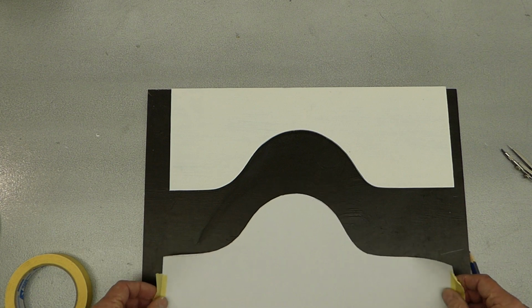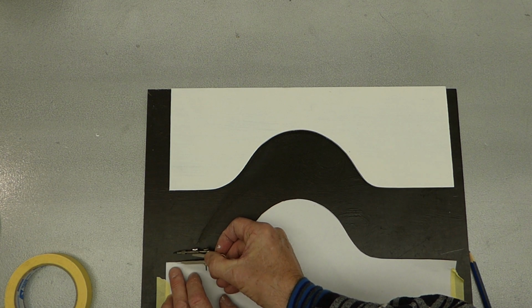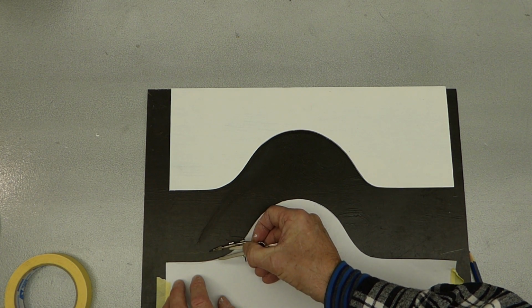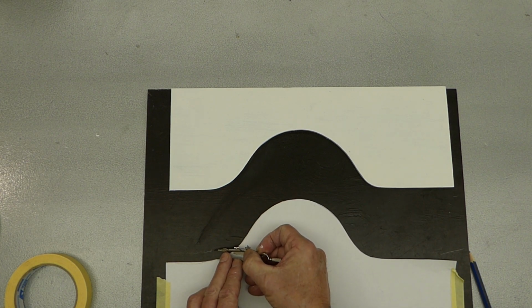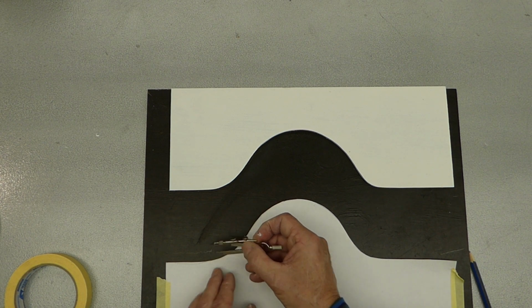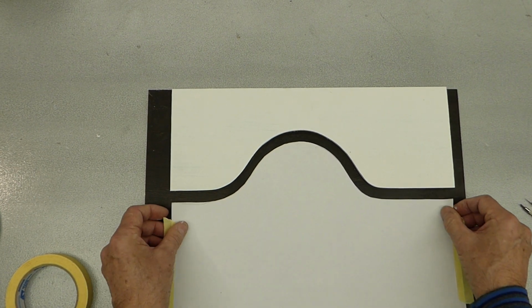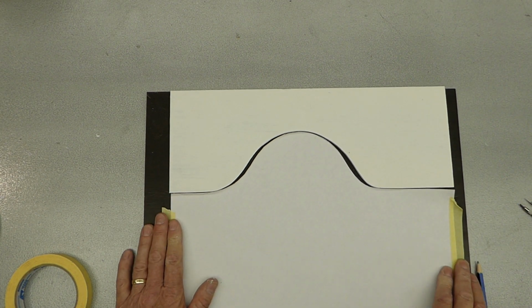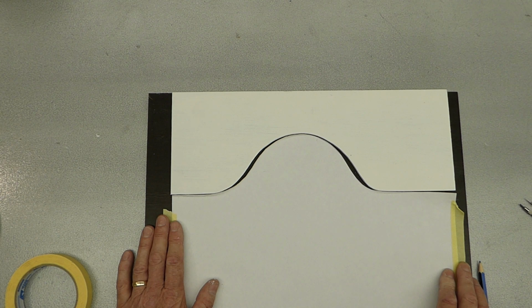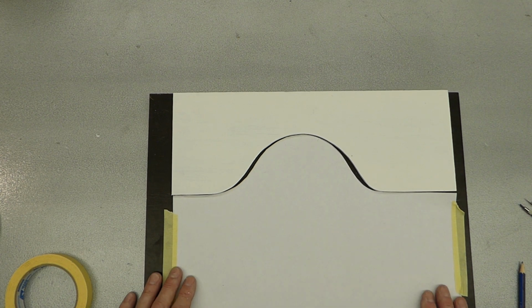Now you could stick this to your piece of timber and then trace around like this, but once again the accuracy is, I've got to have that exactly the same angle that I had when I went around here. But once again you can see it doesn't line up. It never will. It can't line up on a curve. While if I had used the ticking stick, it would fit in there perfectly, as you saw by my other demonstrations.